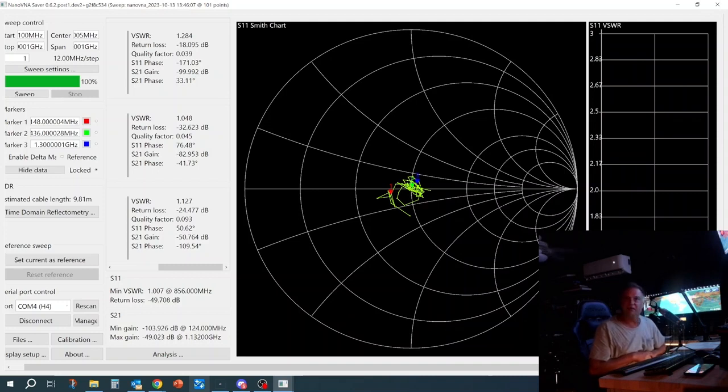The reason is that not too many hams use that. They'll run their big high gain antennas with a lossier coax, especially when you start talking about microwave or 1.3 gigahertz. They'll lose a few dB there. So if you run an antenna with slightly less gain, but you make up some of that loss by running a really high quality coax, now we're talking about 2 S units difference, for something that you can hide in plain sight in an HOA, and I think get very good results.